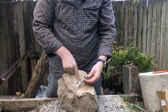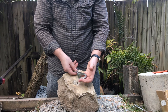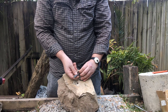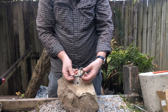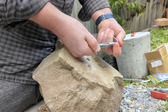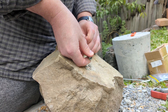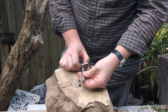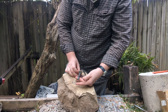The nut is grooved so it's not supposed to rotate, and basically that expands and grips the sides of the hole. But the usual failure mode we see with these ones is actually just a perma spinner. Here's one I prepared many years ago - it was just a perma spinner, basically loose but not coming out because the nut has seized onto the bottom of the bolt. That can happen because stainless steel is pretty prone to galling. When that happens the bolt isn't really going to pull out by itself, but it'll be a bit loose and needs to be replaced.